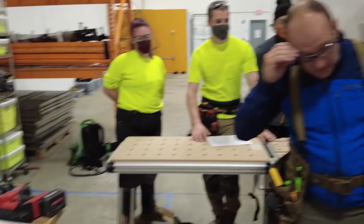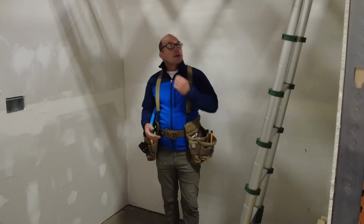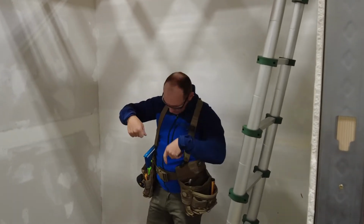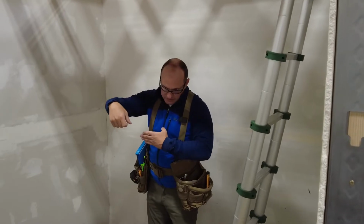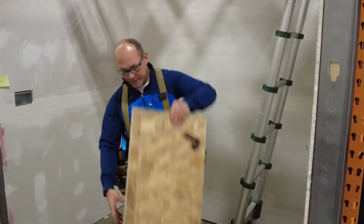Okay. So a few things you need up in the attic, and you need a hatch bag like this, okay? What that'll afford you is to have some tools up there. You have to build this from up in the attic. You could probably do it from here and reach over. But what happens is you're going to be on this ladder, you're going to reach over, and you have this 14-inch piece or whatever it is, and you're going to shoot yourself in the belly. It will happen. So long pieces first, okay?